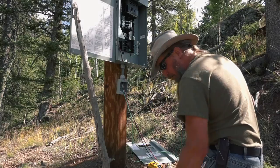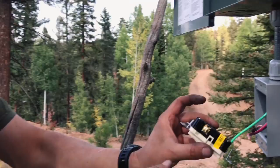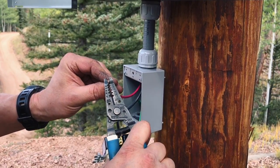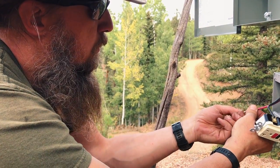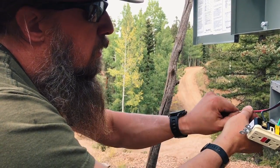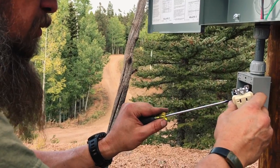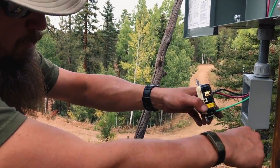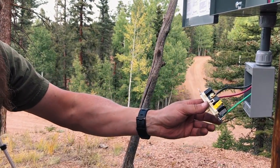You want to be good and snug — you don't want arcing happening inside your stuff. Do you leave yourself a little bit of wiggle room in case you want to snip off that little bit and strip a little more off? Yeah. You can leave a little bit extra and jam it in there — no big deal. If you were going to run another device out the bottom of the box, you can attach them to these and that'll feed other stuff.